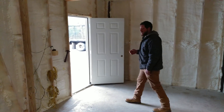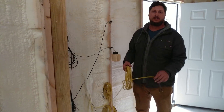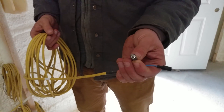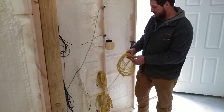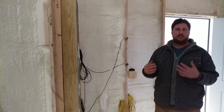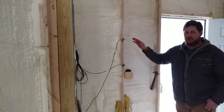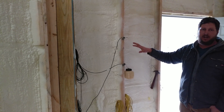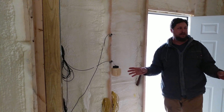One thing that's nice about the Nile systems is that they come with moisture probes. Part of the moisture probe screws into the lumber and then you connect the probes into it. It has a computer that monitors the moisture content so there's no need for going in and out of the kiln constantly checking whether your lumber is ready. It also comes with a wet bulb and a dry bulb system, which I'll get into more later. Right now I'm just going to describe the basics and the design.